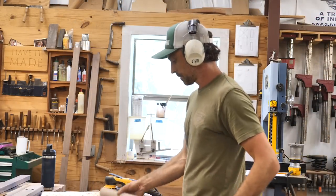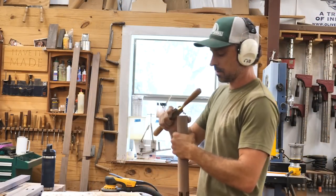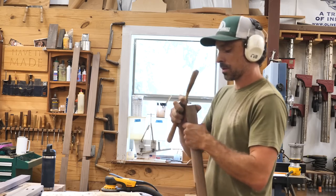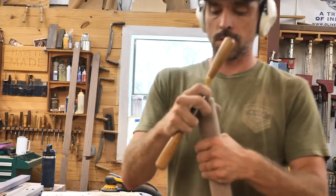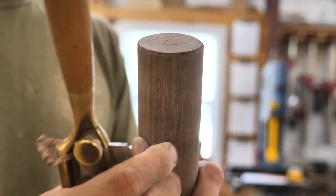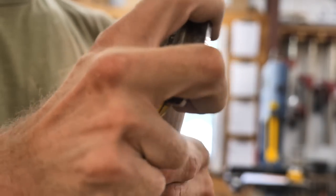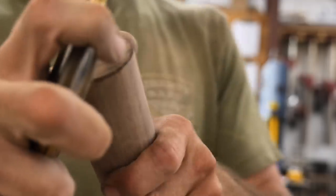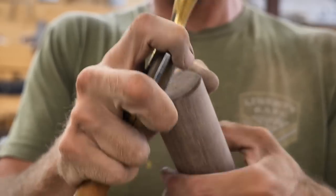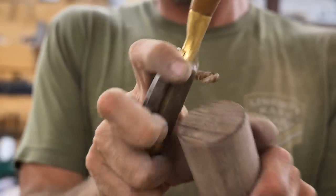Okay, always a good idea to chamfer the bottom of your parts here. So anything that touches the floor, we want to put a nice chamfer on so if they drag the sofa or anything of that nature, it doesn't chip out and break a section. Tables, chairs, anything that comes in contact with the floor needs to have some chamfer on it. Otherwise, when you drag it, it can catch and split out.